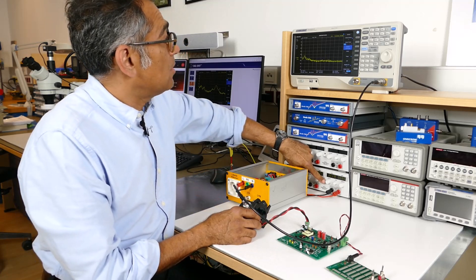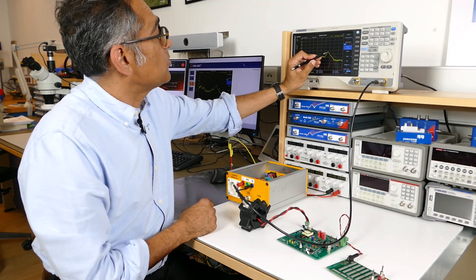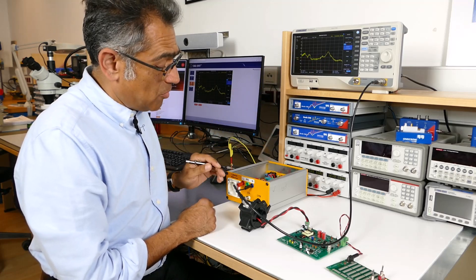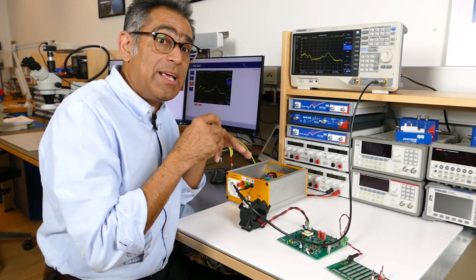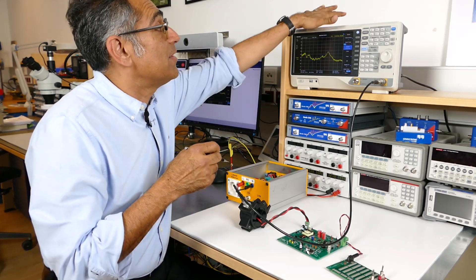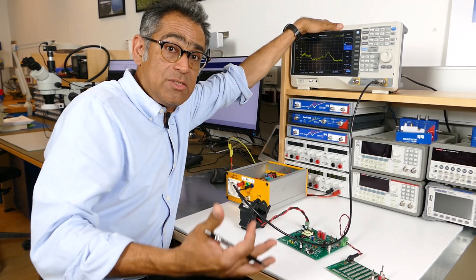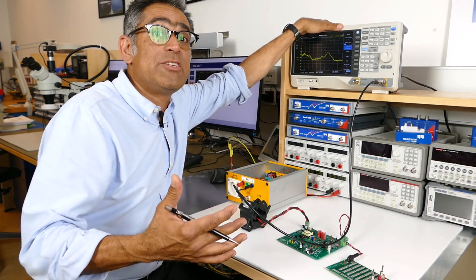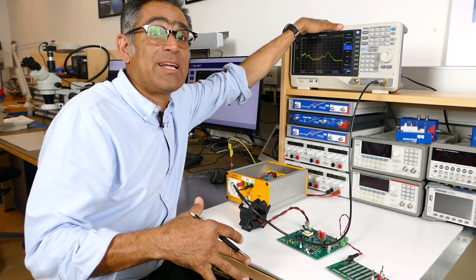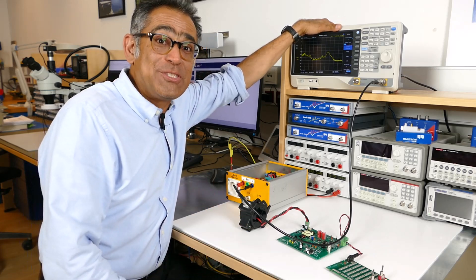You can see there's no power here, and you can clearly see it's picking up around here. You can then zoom in, look at each frequency and each harmonic — that will give you an amplitude that the spectrum analyzer is picking up — and then you convert that into how much current it is. We've got another video which will show you exactly how to do that. Thank you very much for watching and I hope that we see you in one of our workshops.